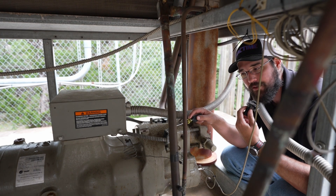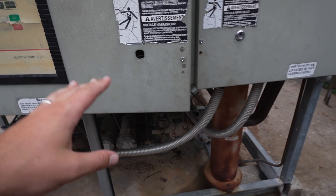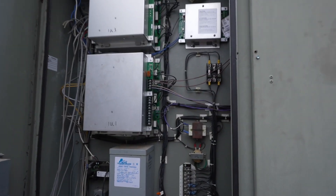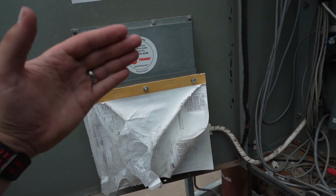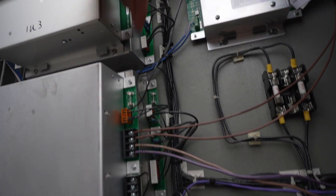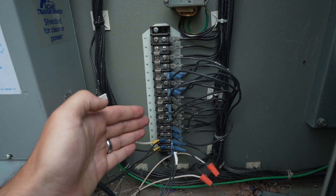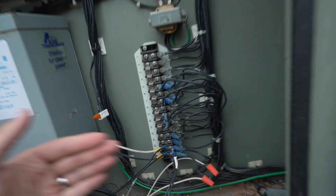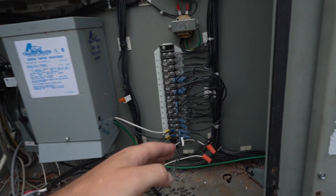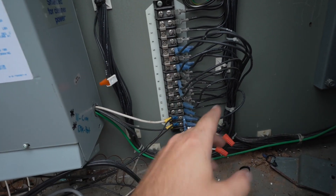That's not supposed to happen. This should have de-energized so that I could fully unload this compressor entirely. That immediately told me we had a problem there and led me to the control cabinet — why do I still have that? I was able to read through the schematic and I found that coming off of my 1U5, or my compressor A module, I was supposed to come down to terminal 13, which was my leaving output to that solenoid. 88A was the input from the control module and 88B was the output going to the compressor. I noticed I only had wire 88A landed on terminal 13 — there was no 88B.